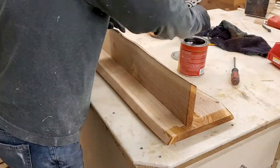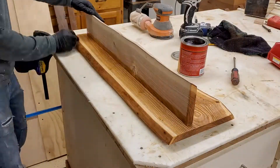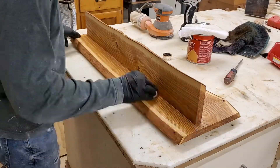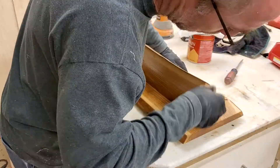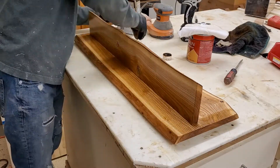For finish, I'm a big fan of this Minwax Pre-stain Conditioner. It does a really nice job of evening out the stain uptake into the grain, and for end grain it keeps it more even with the board and gives a little bit of rich color all by itself. The next coat is Danish Oil in light walnut — on different woods I keep testing different stains, and I keep coming back to this one as what looks best.